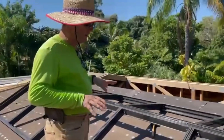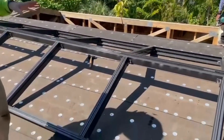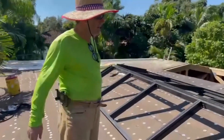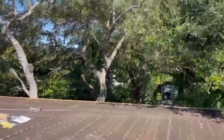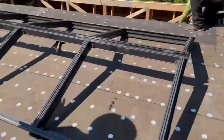What we have to do first is reframe the perimeter with some wood, make sure that the dimensions are okay, and then we assemble the framing. All the skylights — because it's 17 feet long by 6 feet — are coming in pieces. It can be transported, and as you can see, there are trees around and there is no access for a crane. So we have to build everything up from scratch.